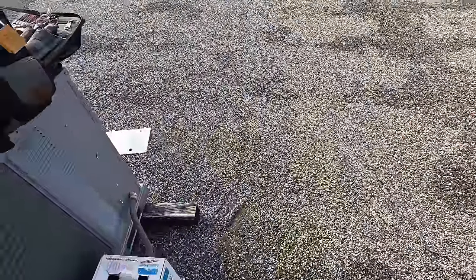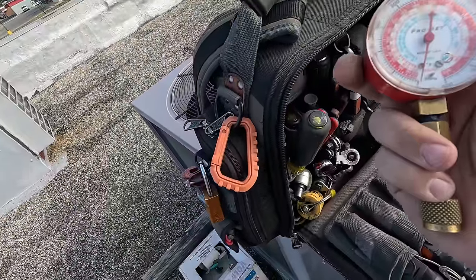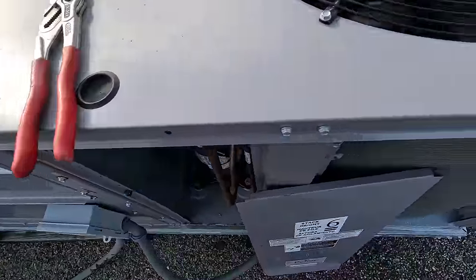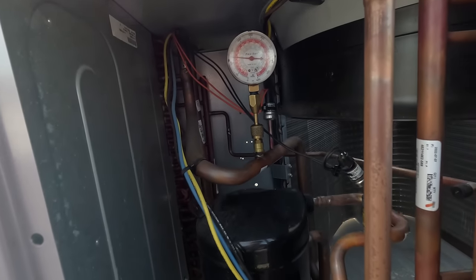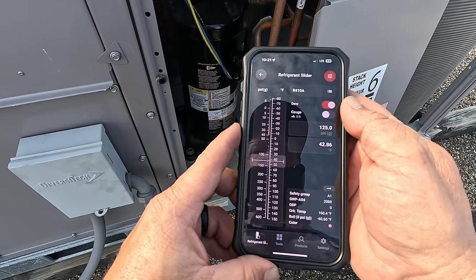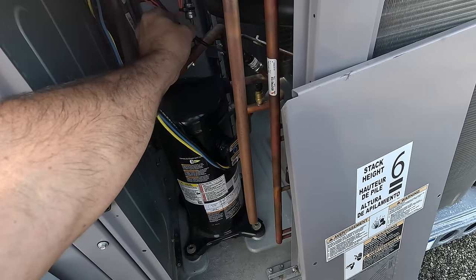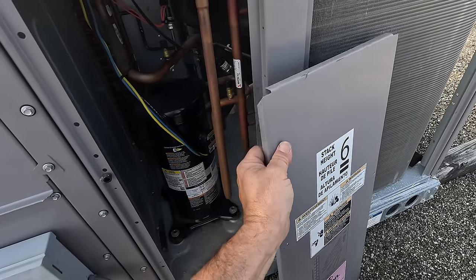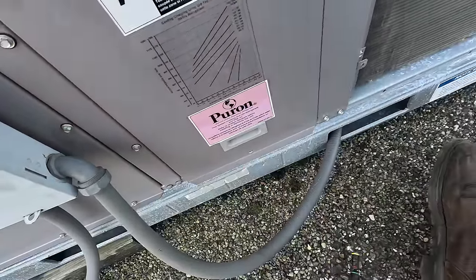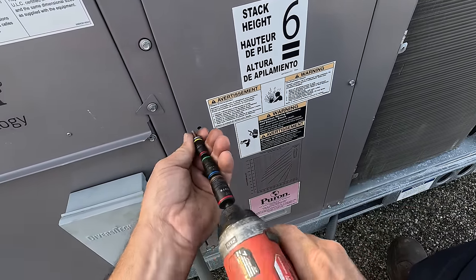Let's see if I can get away with using my 22 gauge — yeah, we can use the 410 gauge. It's not hot, actually it's probably lower than half of them. Running 125 pounds — dew's low on the ground, bubble is high, so we're running a 42 degree evaporator. We're not doing a full-blown check. What we're here for is to get it to run — it was supposedly checked in the spring because the filters were changed. Either way, we made sure that suction pressure is in the ballpark. We're just doing a quick check to make sure we're not missing something stupid that would cause a callback.